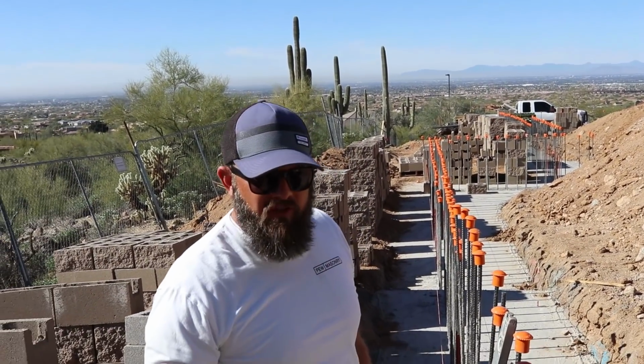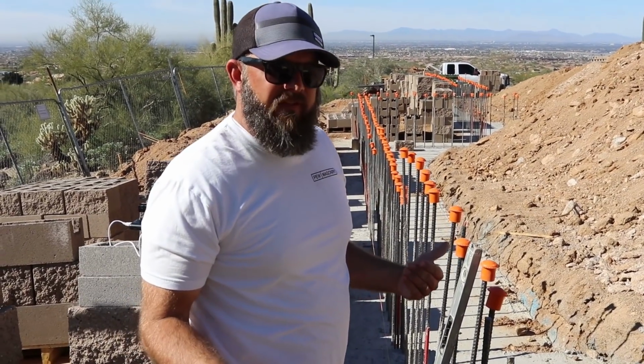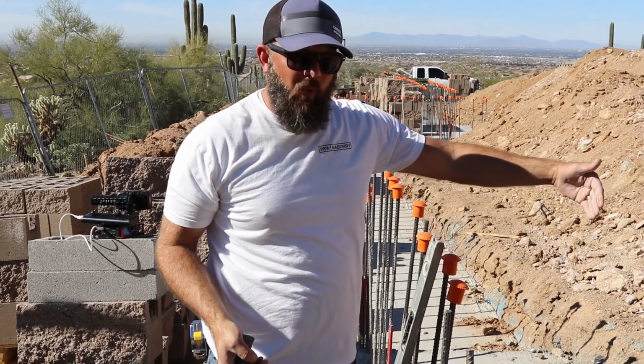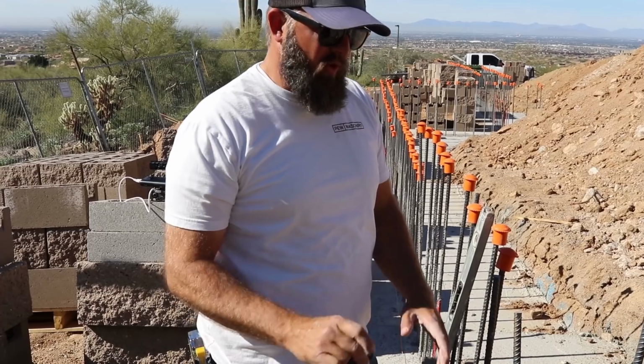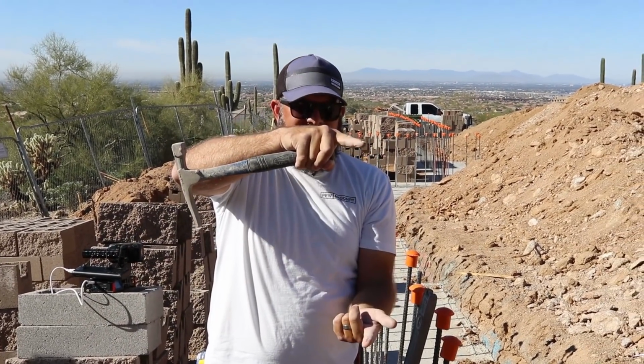Yeah, the survey process is usually a 3-stage process. They'll come and do a rough staking for excavation. We'll get it cut wherever it is. This particular footing is about 8 feet wide. It has a keyway in the middle of it, which is another whole section, so if you look at a profile of a trench, you're 16 to 18 inches.